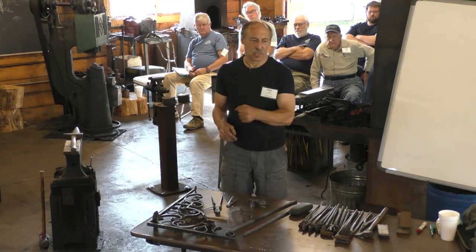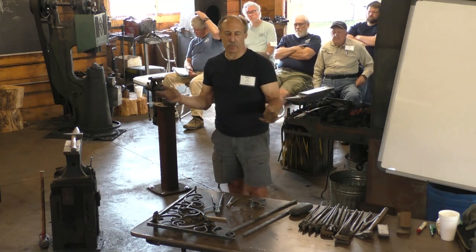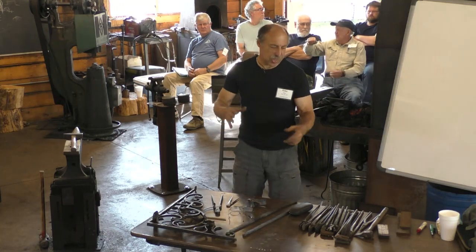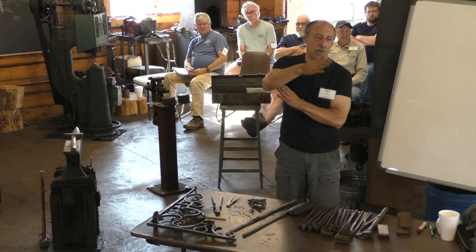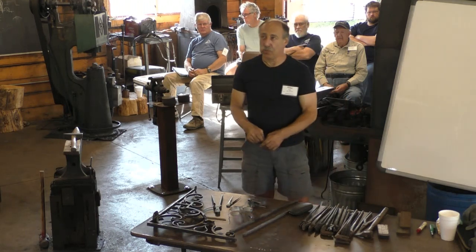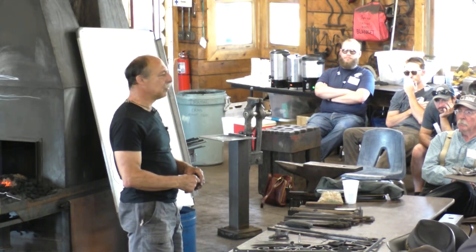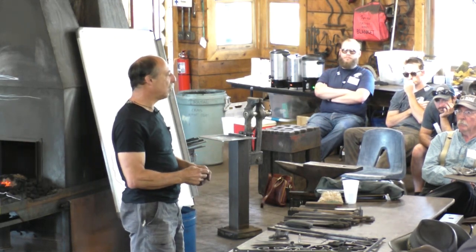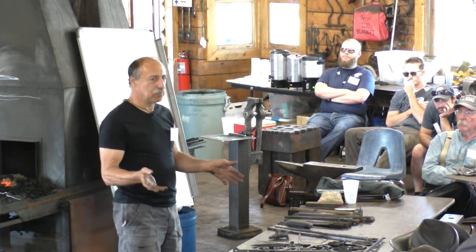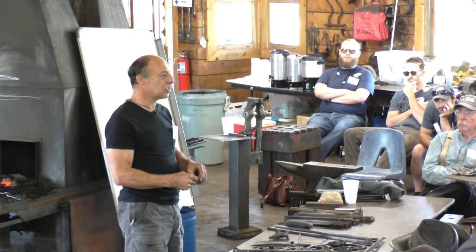Well, it's a brace. It's a brace with a heavy weight on it. And that's called a beam drill. And we use them sometimes. So you could drill with that beam drill. It's just a big brace with a heavy weight on the top. And all you have to do is turn it. We could drill sort of a 5/16 hole through a 1/2 inch in about 10 or 15 minutes. It's not like a modern drill press, but you could make the whole thing yourself and make the drills and drill a precise hole, which you need maybe once every 2 months.